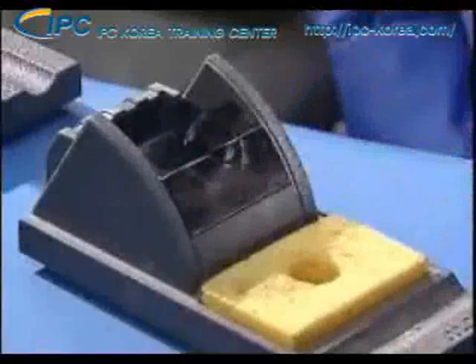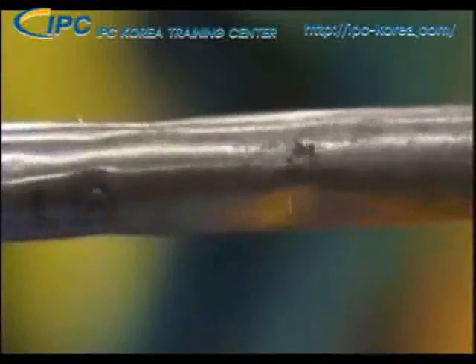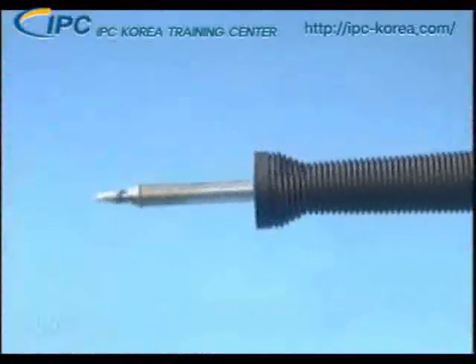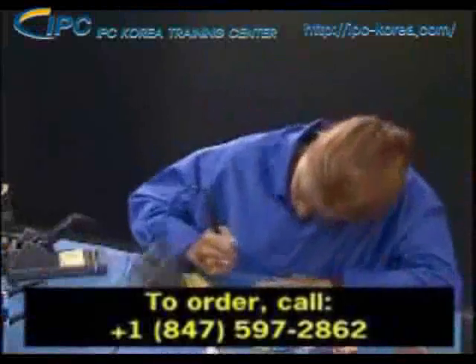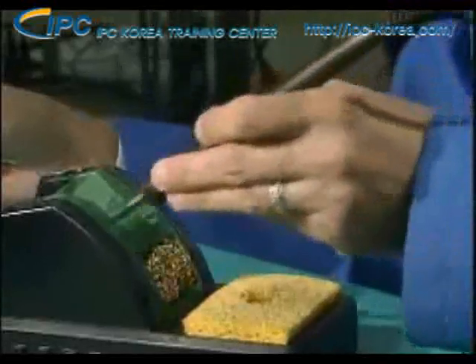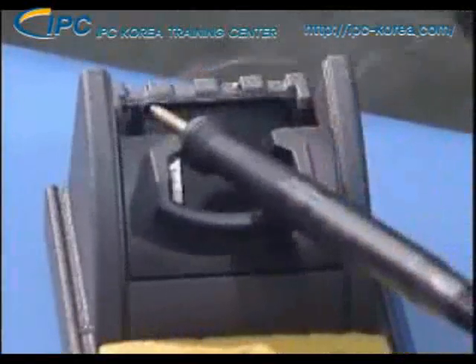Our final topic for extending soldering iron tip life has to do with mechanical damage due to tools. Using pliers to remove and replace soldering iron tips will often create tooling marks on the tips, which will invalidate any warranties. When changing tips, always use gripper hot pads — they won't damage the tips and will also protect your fingers from being burned. It's important, especially with a tip that has a 30-degree long sharp bend, that we not push the tip down against a solid object when inserting it into the handle, as this could damage the end of the tip. Also make sure that the soldering iron support stand is the correct one for the iron, as an improper stand can result in the iron dropping out of the holder.